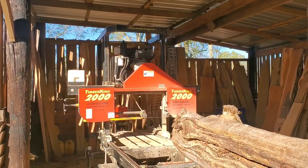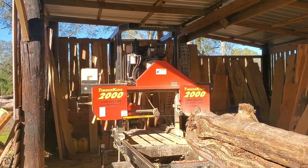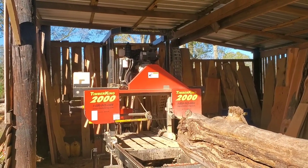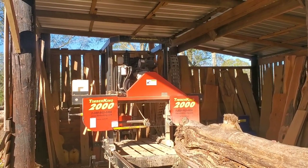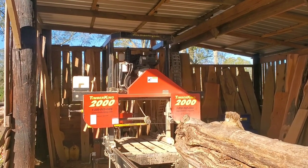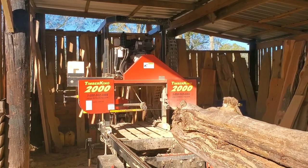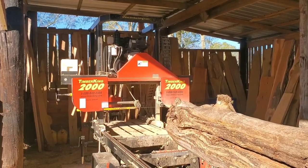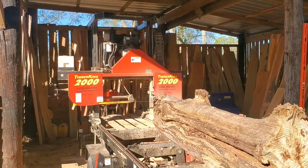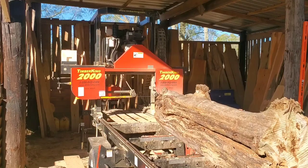I think this one's topping out at like 2300 RPM versus 2600 RPM like my buddy's is running, because I've got a buddy who's got the exact same one and I can tell no differences between the two. In fact, where I'm operating in the torque band on this one is actually better at lower RPMs, and my buddy who's got the 38 horse gas engine, I can outsaw him because this thing's got the torque. If he's cutting a wide log, he says it feels like he's always trying to catch up to the RPMs, whereas with this, you get into the log and she just powers through because you've got all that torque.